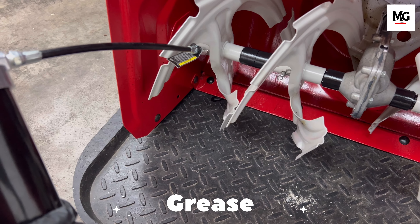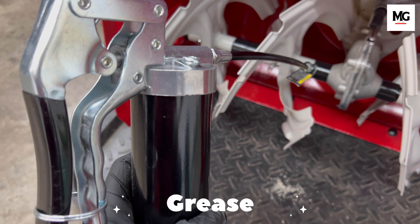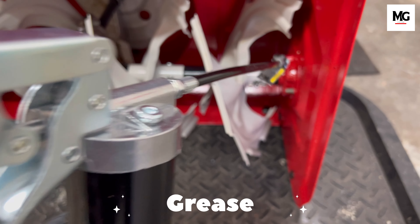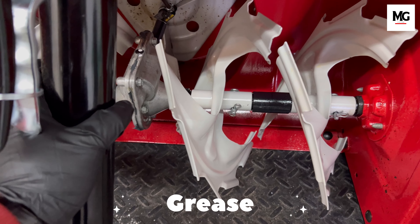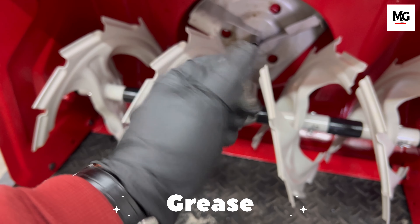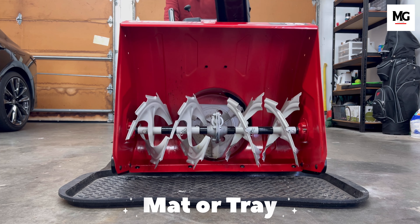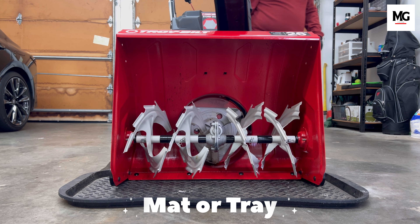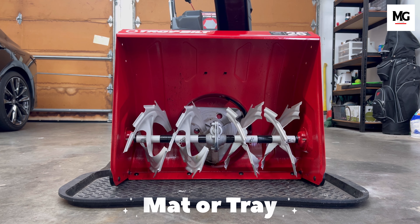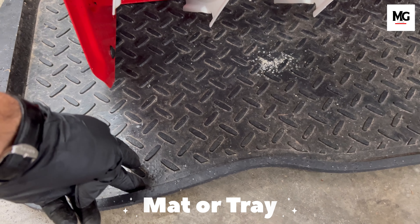One of my neighbors actually rolled up newspaper in his auger before breaking his shear pins. You will definitely need some shear pins — have a couple of these on standby, as they break at the weirdest times. One time I was snowblowing and underneath all that snow was a tree branch. It got caught in the auger and snapped my shear pins. The main purpose of shear pins is to defend your gear box. They are made of softer metal so they can easily snap under pressure. You'll know when you break one because you'll be pushing the snowblower along, moving a bank of snow but not throwing the snow.